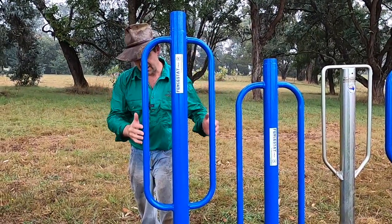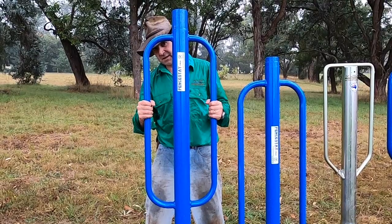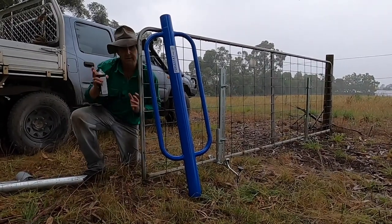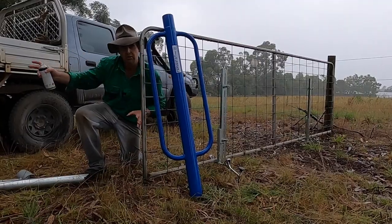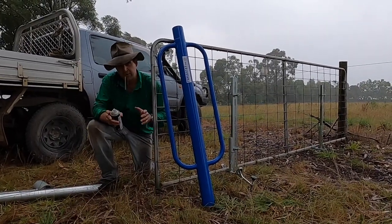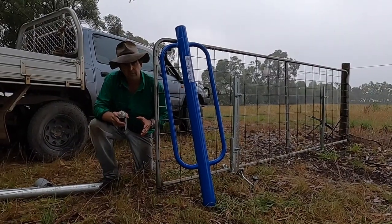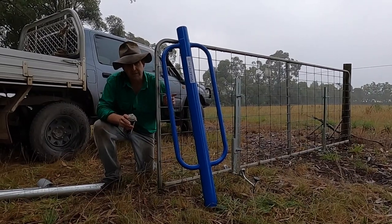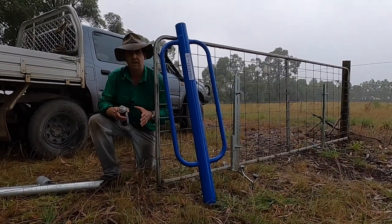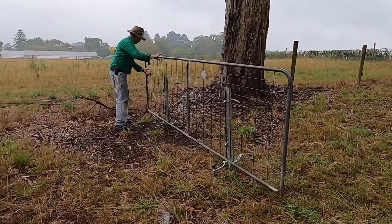This particular driver has a handle that goes all the way down, and that's important because it weighs 20kg. You're going to want to get in nice and close and keep your hands at shoulder height the whole time you're operating it. I'm going to be using the fence stay end assemblies and steel posts as intermediates and running a sheet mesh up the paddock. The hope is that with the new 20kg steel post driver I'll be able to put these end assemblies in even easier without a motorised device. Have a look out for these nifty gate stands in an upcoming video.